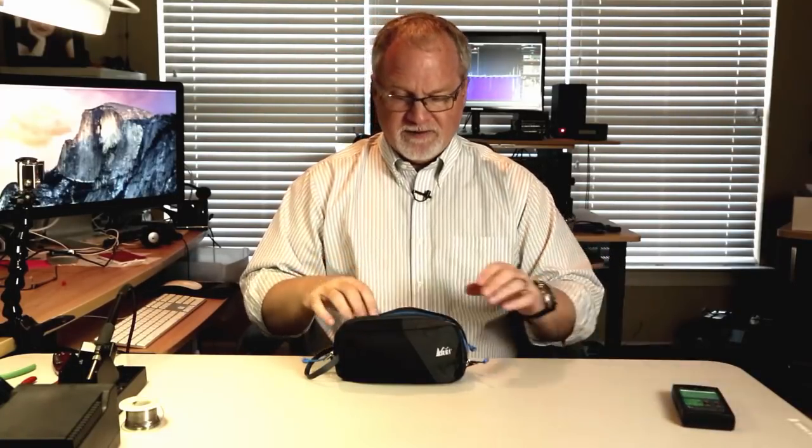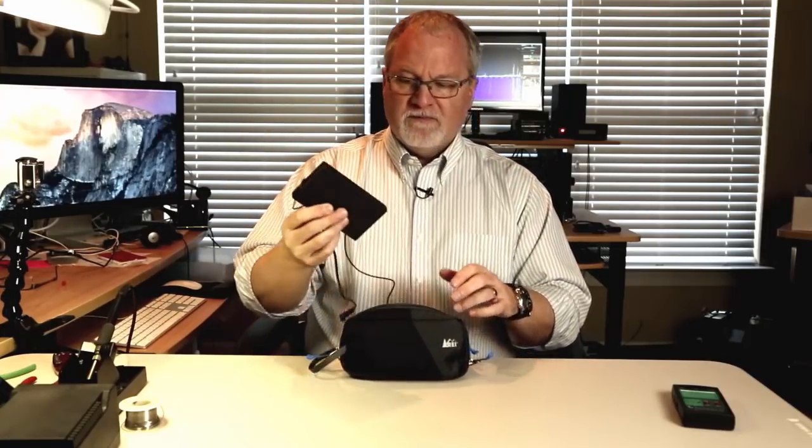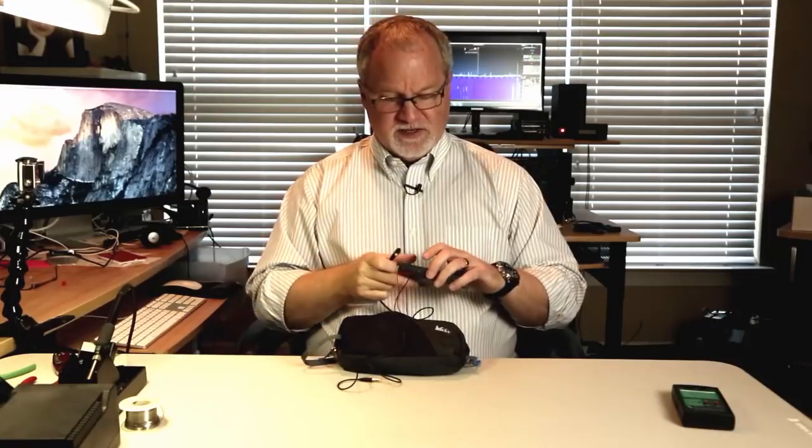The T1 tuner — if you have a resonant antenna, like a dipole that's been cut to whatever band you want to work, you won't need a tuner, so one less thing to carry. My battery pack — I've got a jack soldered on here to these wires. This is the same jack that an FT-817 Yaesu radio takes, about 1.7 millimeter pin by 4 millimeter diameter. My batteries are nickel metal hydride, 2700 milliamps. I get about 11 volts initially when I charge this, and I'm very happy with the battery life and the 3 watts out that I get.